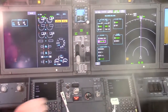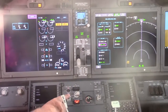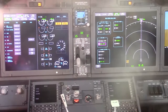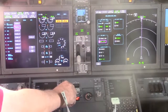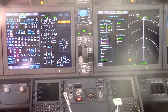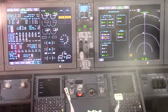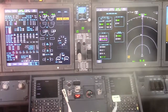Use the captain's inboard display OMS screen and select. Scroll to maintenance data pages, scroll down and select 27 flight control display. On the bottom of the screen, ground spoilers will be in view. During the test, observe ground spoiler extension and retraction from this page. Return to the FO's inboard display.